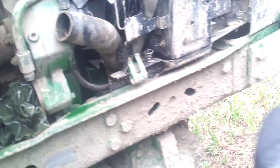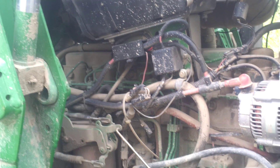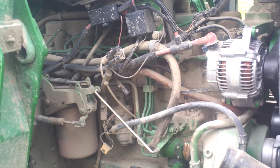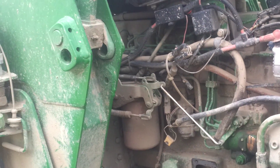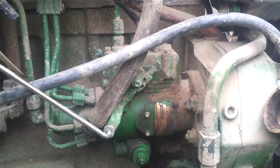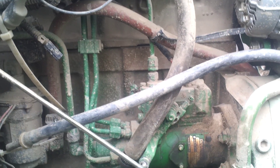Here you have your stereotypical John Deere six-cylinder engine — I think it's seven and a half litre. It's been around for a long, long time with different horsepowers. This one is 150 horsepower but I think the new ones are around the 200 mark. They're all computer-controlled nowadays, but this one has a good old-fashioned direct rotary injection pump — manual, no computers to work the engine, although there are computers for the link arms and stuff.